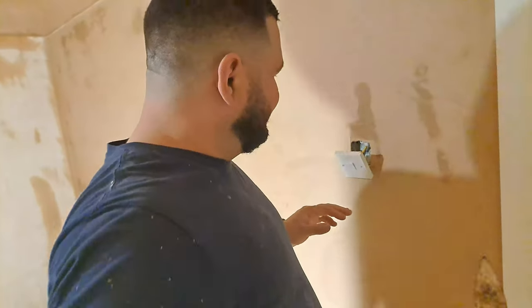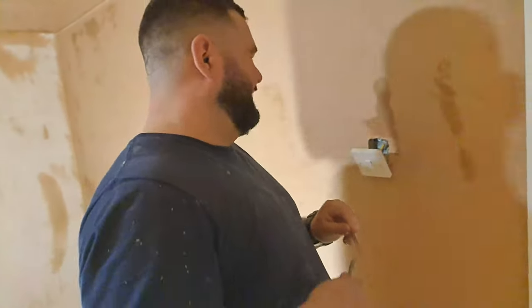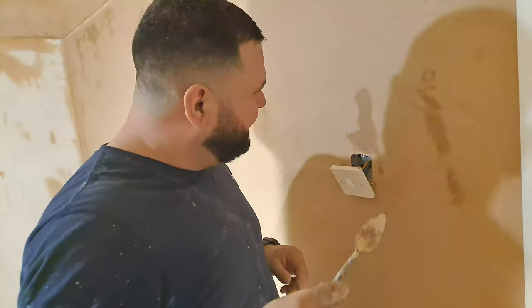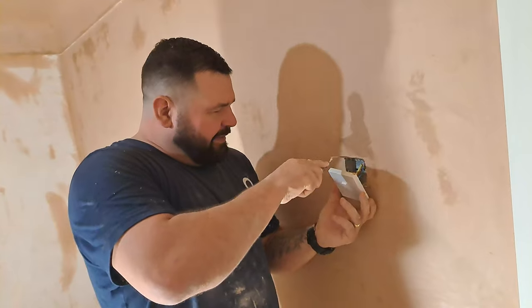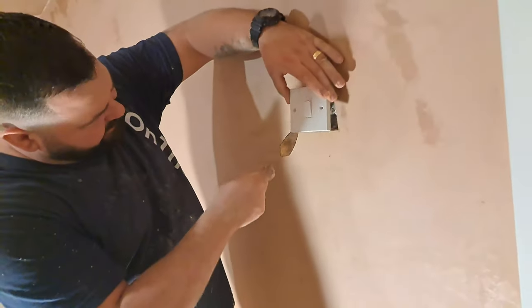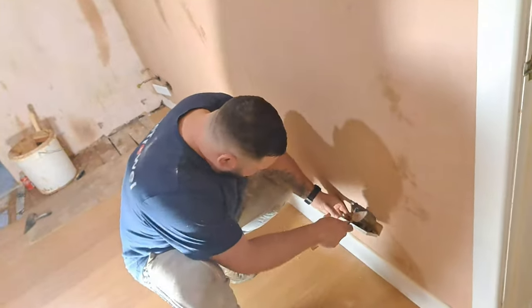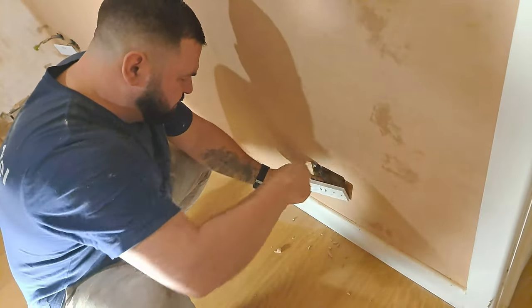Now, I always get moaned at for all sorts of safety issues like seat belts and guards on grinders and dust masks and all sorts. There's my next one for you. Don't do this, right? Don't take a metal small tool and stick it in where there's live electrics. Just turn the power off. All right, unless you're nuts like me and you don't care. But either way, now is the time you want to clean your boxes out. Okay, our lovely friends, the electric chickens, like it if you don't leave their back boxes full of plaster. So whilst it's still soft, it's a lot easier to clean it out now than let it set.